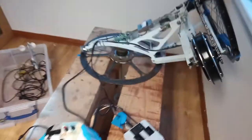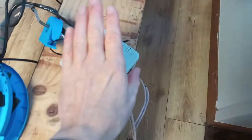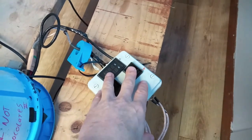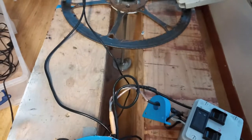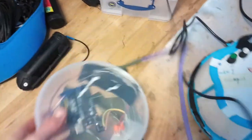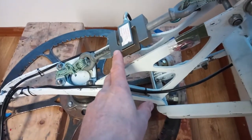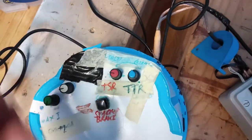Onto the control. You've got the power — main power box, the batteries. Two bike batteries down there — they would plug into here. You can turn either one or both on at the same time, keep them parallel. There's an Arduino which has an anemometer coming into it — it feeds a controller in here. This is the main control box. This box takes the power in, takes the anemometer in, and it's got the connector to the motor. We've also got the inline tension sensor. So the anemometer, motor, tension sensor, and power all go in here.